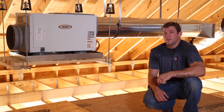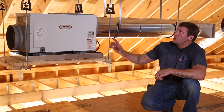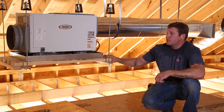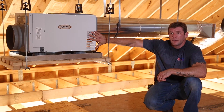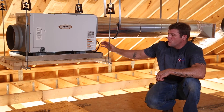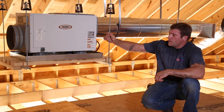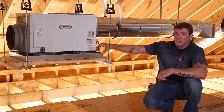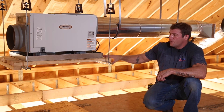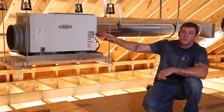One of the biggest things I see people do is build a platform prior to going to the job site, and I think this is an error. You don't know exactly where your joist spacing is and how long the platform needs to be for these threaded rods to clear the service side of your unit. So before we build our platform we make sure that we have enough room for these rods to clear any filters and any serviceable items, and that there's clearance for our drain pan and risers. This platform was built wide for a reason — it's going to allow us to easily work on this piece of equipment.